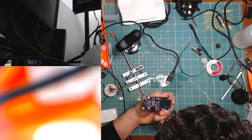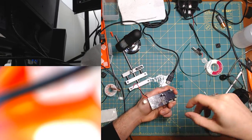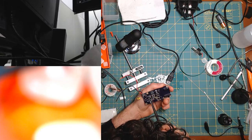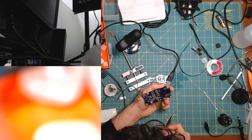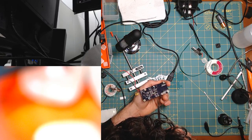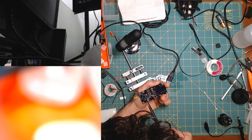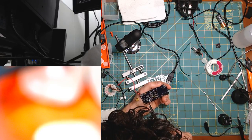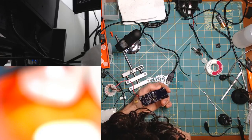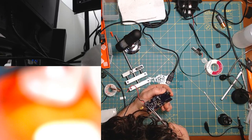I mean, I've had to, essentially, here I have how many? 21. 21, 22, 23 candidates for shorts. Every single LED could be making a short between ground and battery. It's actually very likely it's one of the LEDs. The regulator could also be generating a short, and the wireless charger chip could also be generating a short. Oh, 24. There's also the magnetic switch.